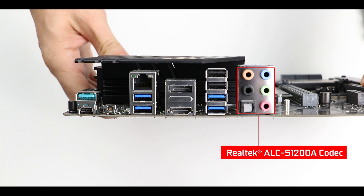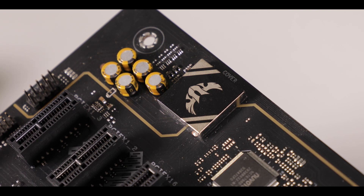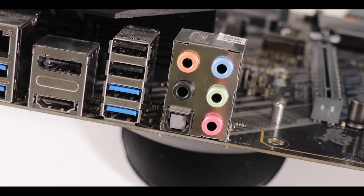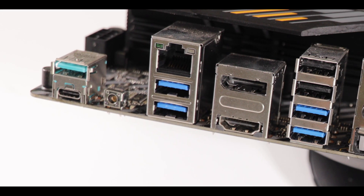And finally, we got our 8-channel ALC S1220A audio codec from Realtek, which is about the very best integrated audio codec you can have in the industry. I was very surprised to see it on such a budget motherboard with only four PCB layers. After testing the sound, I noticed no signal bleeding into the left and right audio channels, probably because they're still on dedicated PCB sheets — absolutely the best performance both in playing and recording, which is extremely important especially in non-grounded houses. Overall, the I/O is rather well-featured and luxuriously done so — kudos to ASUS for that.